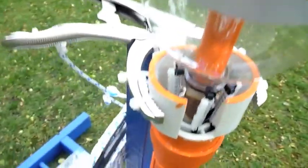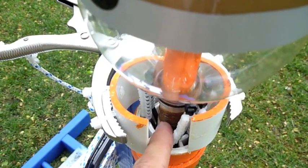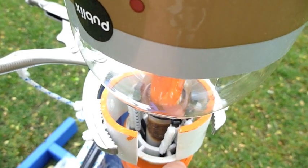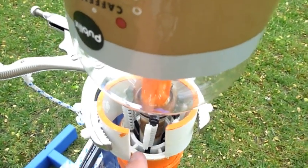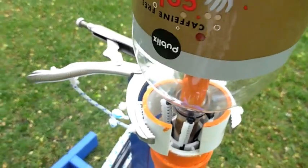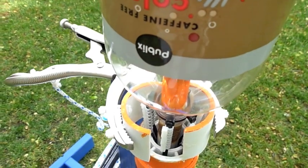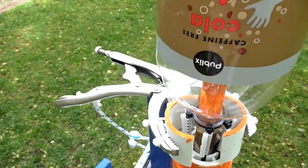The top adapter has an inch pass-through in the middle so the half-inch PVC fits through with no problem. This little gap here — originally solid inside the fitting — we drilled out all that solid PVC all the way around and ran the cable ties through there. We put one cable tie per section and there are six sections total. Six cable ties is plenty to hold the bottle in place, and it doesn't interfere with any of the threaded parts, so you can still raise or lower the assembly as needed for different bottle sizes.